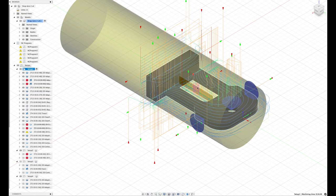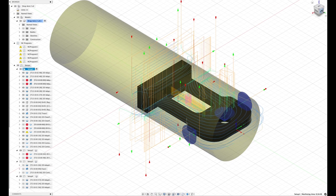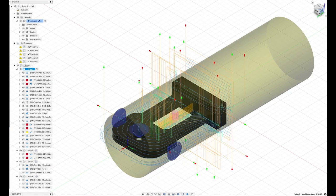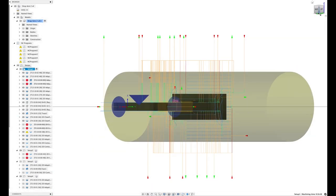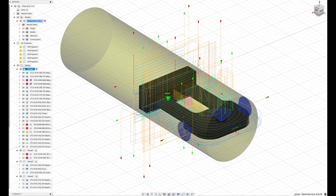Design for a little bracket. It's a part that doesn't really need much in the way of precision, but I thought not only would it be fun to mill it, I'd like to try it all in one setup on the fourth axis. It's all simple three-axis work, but in doing it this way, I don't need to move it in and out of the vise and retouch off zero every single time. It'll just rotate and do the next operation.